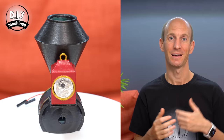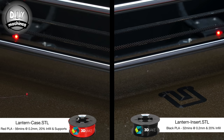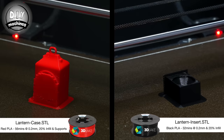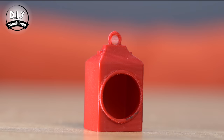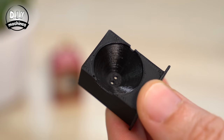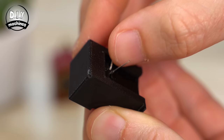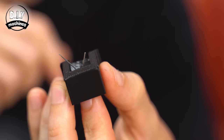Let's start working on the lantern, including the LED, for the front of our train model. You need to start by printing the inner and outer of the lantern case. We will first attach our 5mm LED to the lantern's insert by inserting its legs through the two holes inside the cupped basin, and then spreading them apart from the reverse to hold the LED in place. Our resistor will be added to the positive, or anode, leg of our LED — the longer leg.